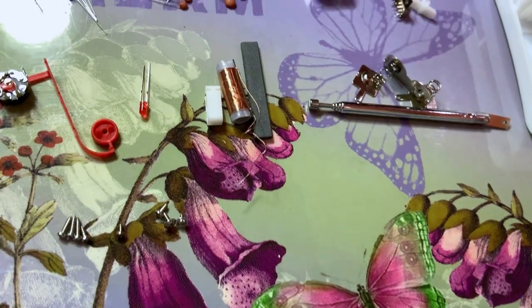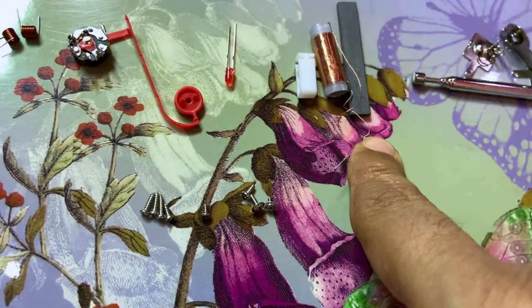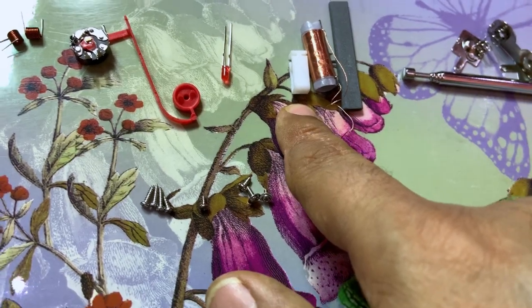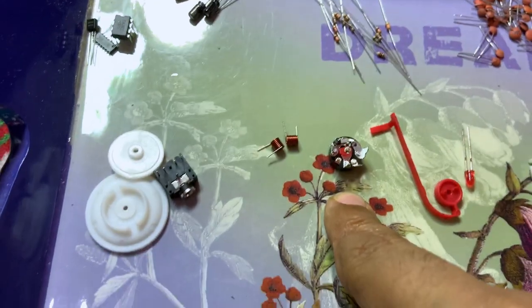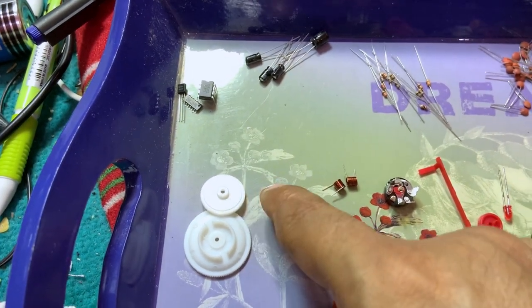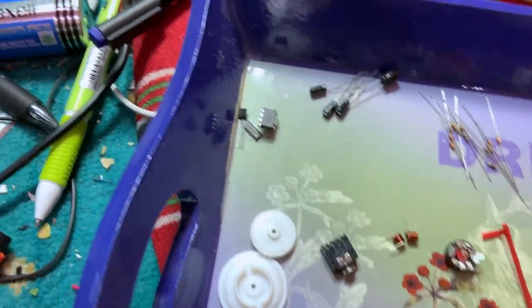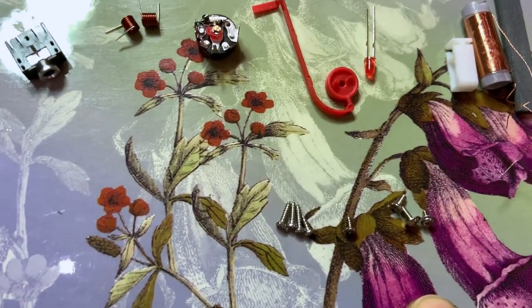We have battery components plus the antenna. We have a ferrite rod in addition to the RF coil, then a holder for the ferrite rod, an LED pointer for frequency and the level, a 10 kilo ohm potentiometer, 2 FM RF coils, an earphone stereo jack, and 2 knobs for tuning and volume. And we have, of course, the screws, which we have divided into 3 groups.